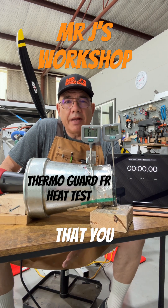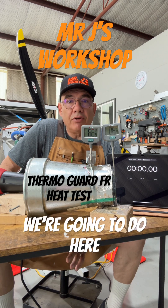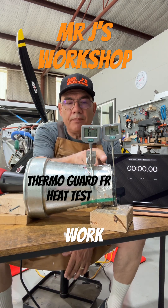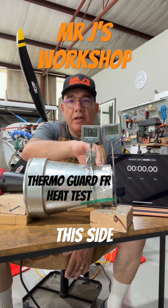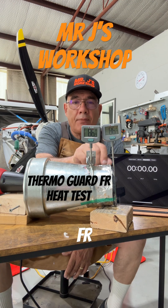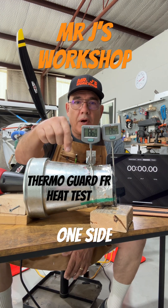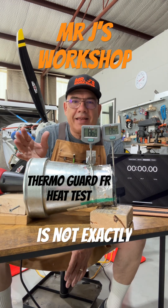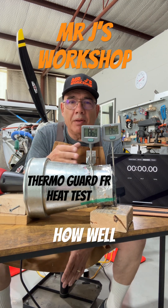He told me, I recommend that you really test your material before you use it. So what we're going to do here is I'm going to run a test. I got some duct work. I fastened the same thickness material that the firewall is made out of on this side and put the quarter-inch thermal guard FR against that material. I have a temperature probe on one side and a temperature probe on the other side. This is not exactly going to be precise, but it would give you a good ballpark figure of how well the material handles.